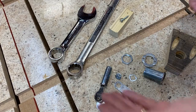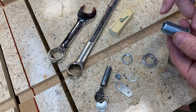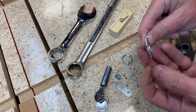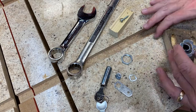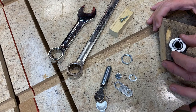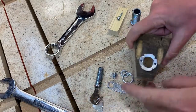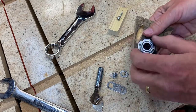The lock mechanism has a lot of parts to it. The barrel itself is available in several different lengths, so depending on whether you're using three-quarter material or something larger, you can get this in different lengths. We'll put the barrel in. This is the inside where I drew the pocket holes. We'll also use this plate here, which has spikes in it that dig into the wood. The lock mechanism comes in, and then the nut — you can use a seven-eighths inch wrench to put this on, but I also have a stubby 22 millimeter, so I'll use that.